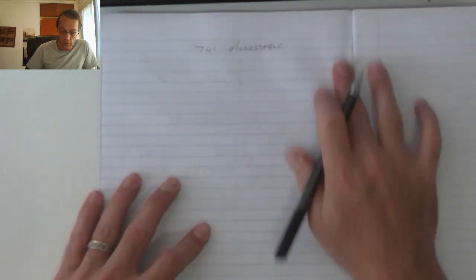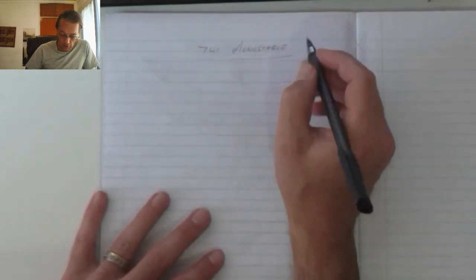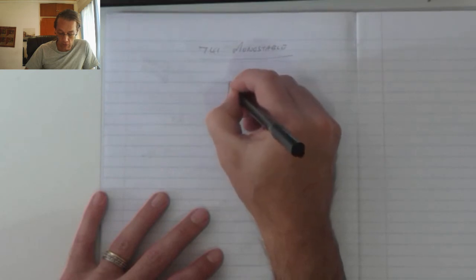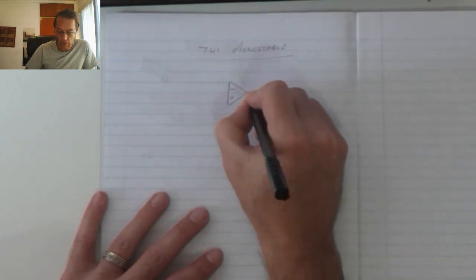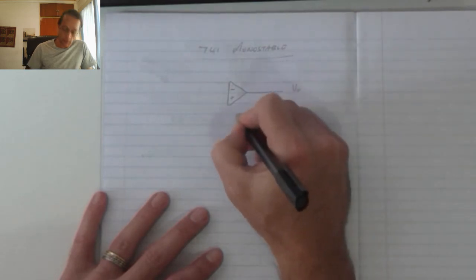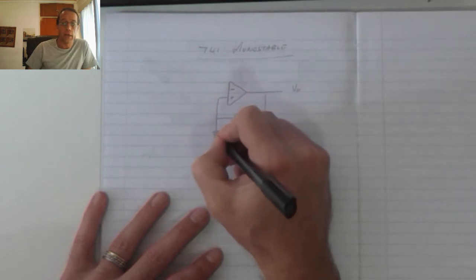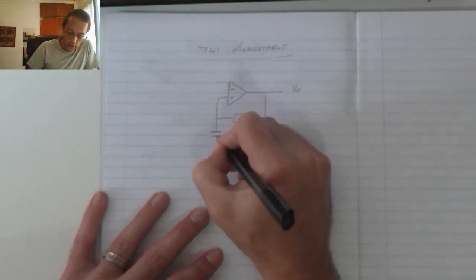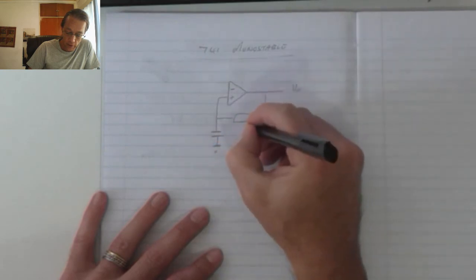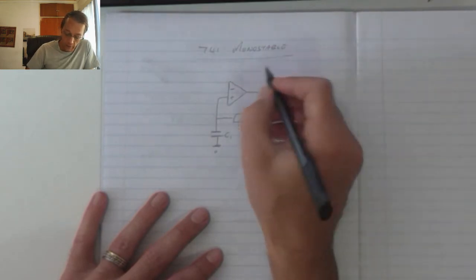Okay. The construction of this circuit is very similar to that of the bistable. We've got our op amp, inverting and non-inverting inputs. That is my output voltage, and again we've got a feedback network. But instead of a resistor over here, we've got a capacitor that connects to 0 volts. Call this C1, that is RF.